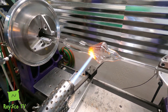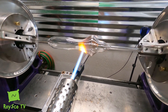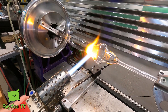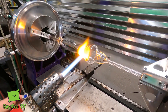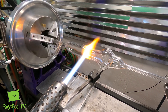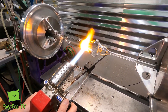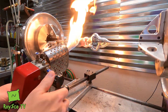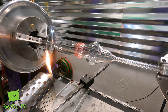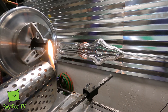I'll do that a couple more times just to get this base really wide. Right here is where that little waist I mentioned earlier is going to be, so I'm focusing the heat on that section, condensing it down a little bit and pulling it a little bit smaller than the original 44mm tubing size. Then we'll go up here and start shaping out the bulb on top, where the neck will be attached. The downtube is going to be dropped in through there and the joint attached, where the water is really going to be dancing when we're ripping it. You can see I got most of the bell shape done, so I'm going to tear it off the 44mm and get the neck ready to add on to the top.